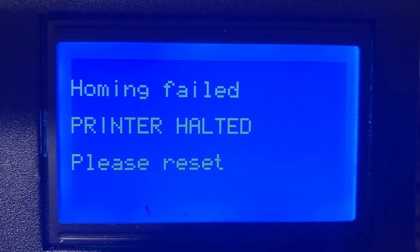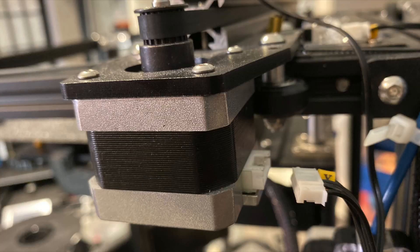Here's what happened — I began to panic. I thought I broke my printer. I re-sliced the image and loaded it again. Same thing happened. I went to the front console and tried to manually auto-home the printer. Same thing. I figured I had really messed up my firmware, so I downloaded a fresh copy of the firmware onto my printer — my Ender 5 has been upgraded with a bootloader, so I can use the Arduino tools to upload firmware. But same result. Then it stopped making sense, because I knew I was running on solid firmware. I looked around and a cable had come loose — the cable on my X-stepper motor. So the lesson here: don't panic. Before you look at anything else when major things go wrong, just check that your cables haven't come loose.